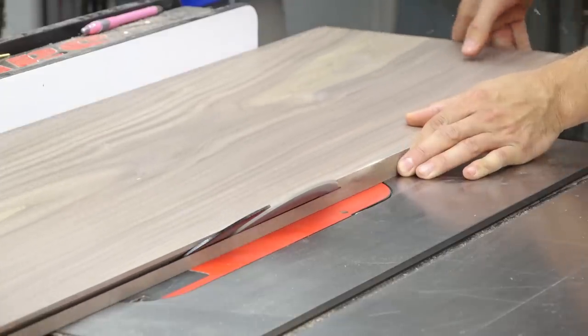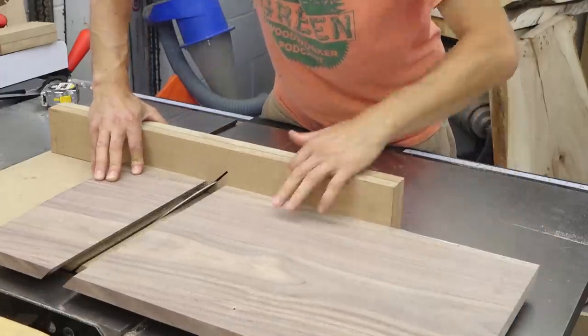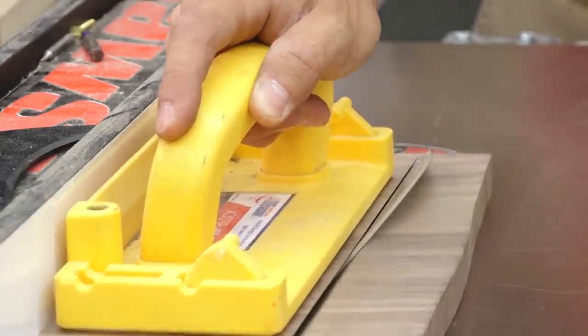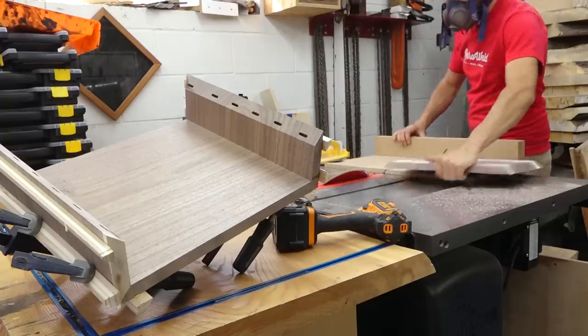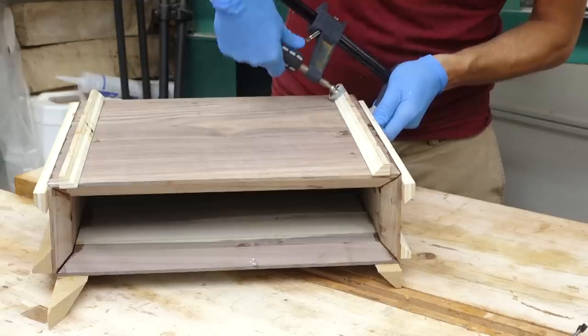The case might be done, but the next thing I'm going to work on is the little drawer boxes that sit on top of the desk area. This is essentially just some mini versions of the case — the joinery and construction is exactly the same. The work pieces are smaller though, so I can use my dedicated beveled crosscut sled to make the initial cuts. Similarly to the case, the top and sides are waterfall. I'll do those first and then cut and fit the bottom to fit.